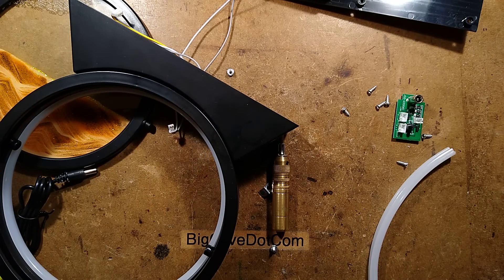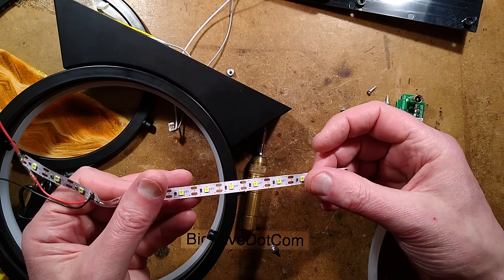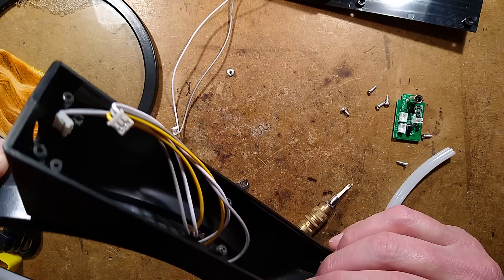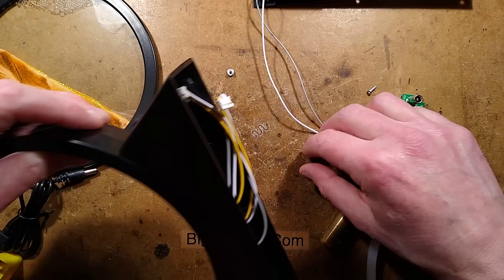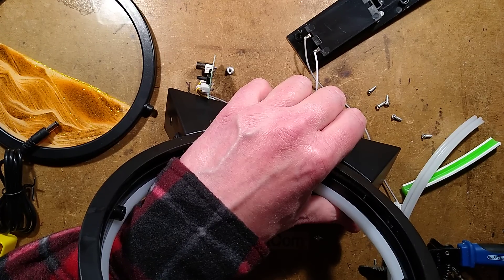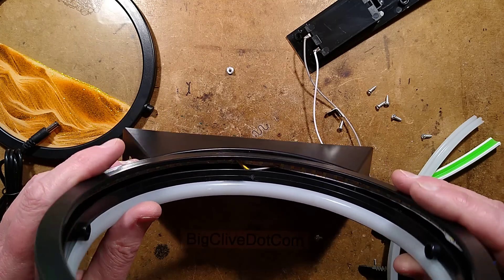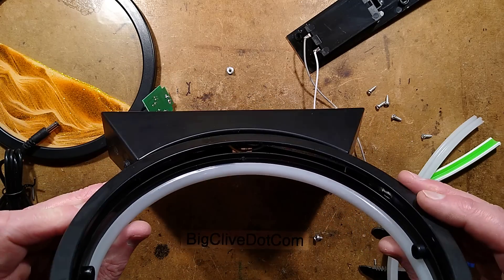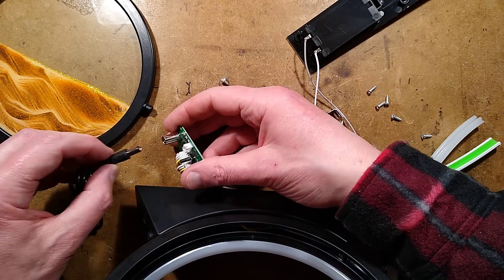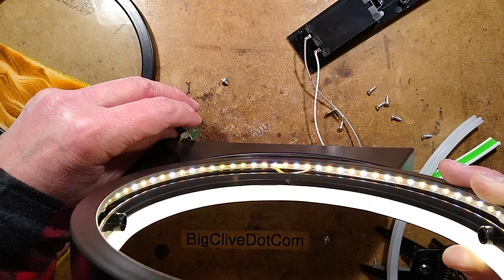This is just a single color though. Right, I'm just going to solder that wire back on and we'll give it a quick flash and see if it works. One moment please. Okay, it is soldered back on. It was very hard to get in there because there's a very narrow channel - the only other way would have been taking the LED tape out, but I don't know if this is put in and then clipped together afterwards. I think it might be glued together. But it is together again. Hopefully this is going to work - let's find out. Click - there's cold, there's warm white. That's what we're looking for, and then both together - excellent - and then strobing.